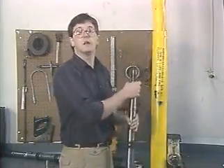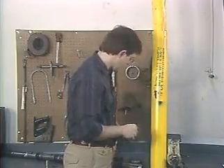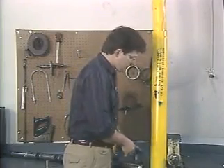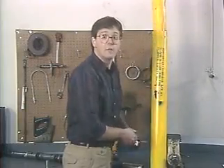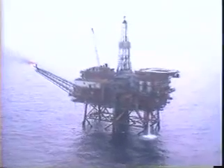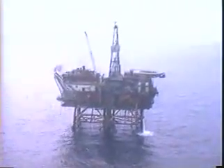These valves come in a variety of designs, which may have single or dual hydraulic control lines, either ball-type or flapper-type valve mechanisms, and special material designs for sour, sandy, or high-pressure service.